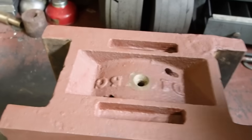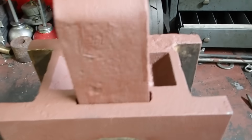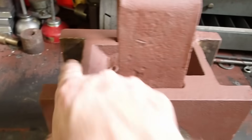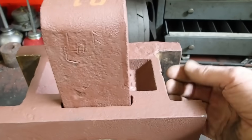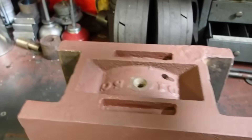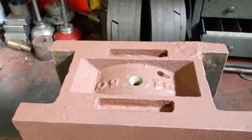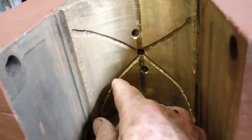The way you oil this engine is you stick your oil can in at these corners and flood some oil in, letting it slop over — just generally make it nice and messy. The external oil runs down and lubricates the pedestal liners, and the oil that runs in lubricates the bearing. There's no way to reach the central hole as originally drilled — those holes just went into the brass and ended there. I've since drilled them through so they will work. Looking underneath, the brass has a groove to distribute the oil, and the original hole they drilled was a complete waste of time.